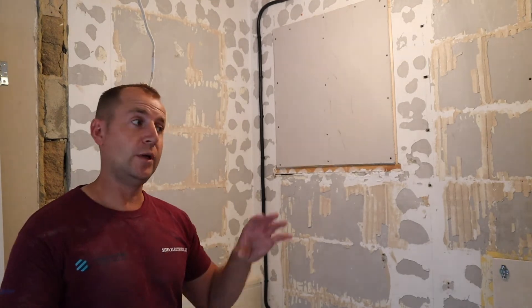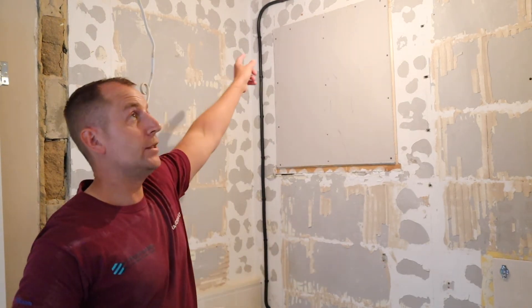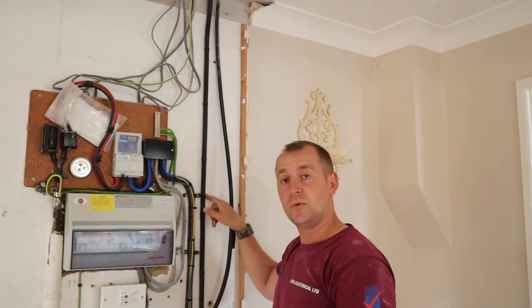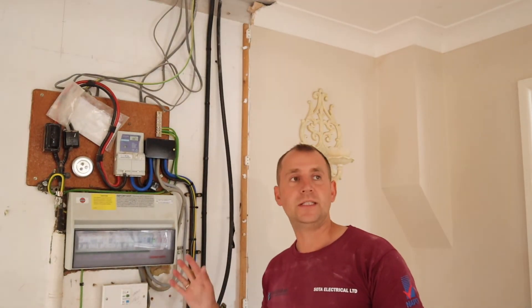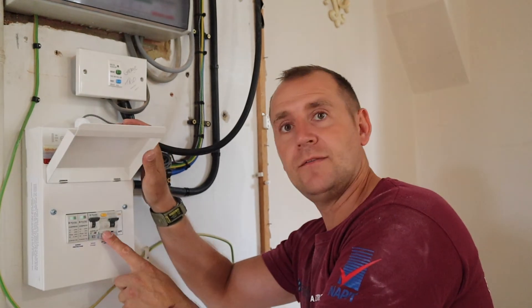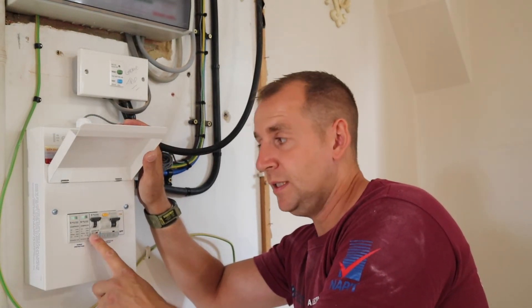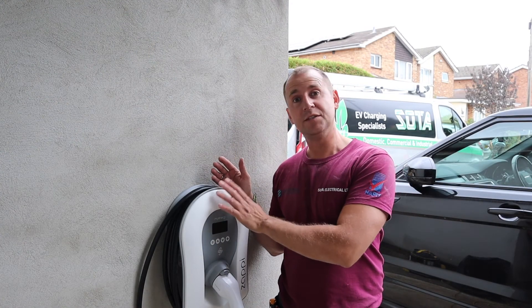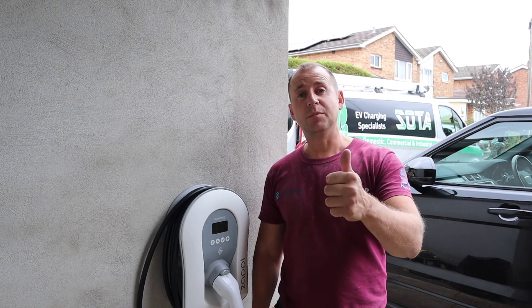Let's have a final run through the job. I ended up changing the cable route in this downstairs cupboard — the cable now runs up the side, along the top, and then through the first-floor floor space. The cable then comes down the wall there. Please excuse the hanging cable — that's not mine, it's part of the rewire that's ongoing. We then have my new consumer unit with a Type A double-pole RCD, a 32-amp MCB, and surge protection. So if you're renovating and you've got walls and ceilings open, take the opportunity to run an EV cable to an outside position where you may want a charger in the future. And finally, here we are outside with the white tethered Zappi. Thanks for watching — please hit that thumbs up and subscribe to my channel.